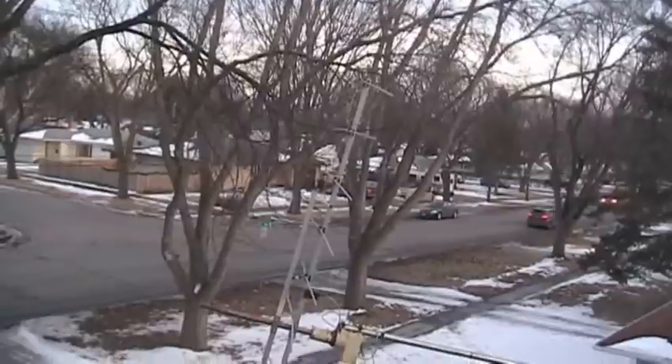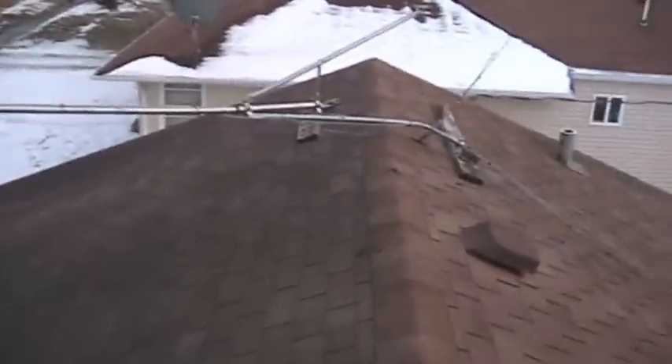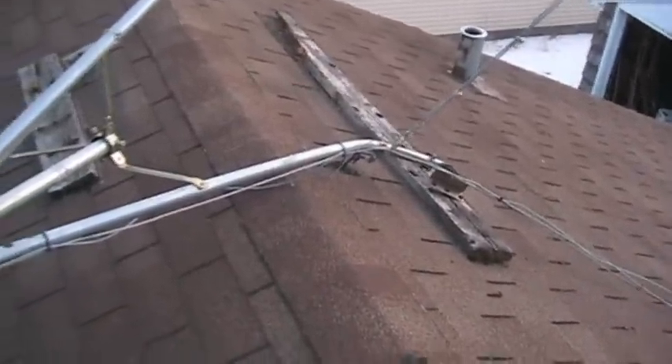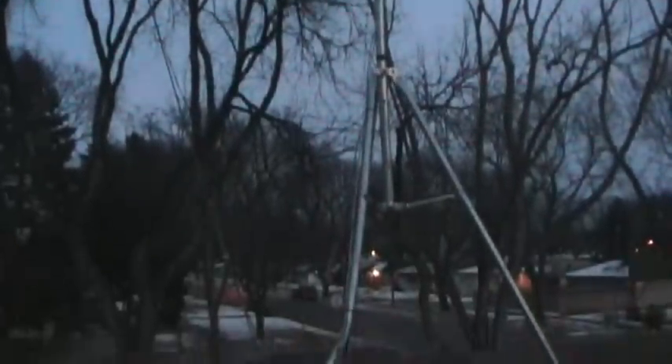It is now a single-bay Yagi. The one thing we're going to have trouble with is the bent leg over here, which means once we stand it up it's not going to stand straight until we can somehow straighten that out. The guy wires will help hold it up. As you can see the tripod is really hurting — we've got a real bad kink in that leg, plus it doesn't want to screw down into the two-by-six, which is pretty much rotted. That kink means it'll come over again probably next big wind.